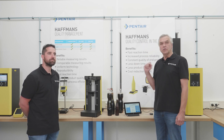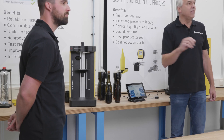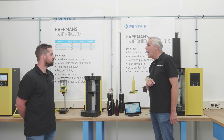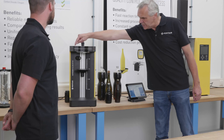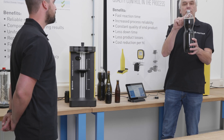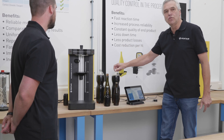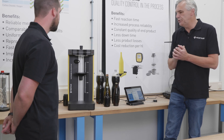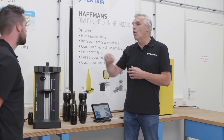The instrument is designed for PET bottles and glass bottles. The principle of the measurement is based on laser technology — non-contact technology. A laser brings the light through the headspace of the bottle. In the headspace there is CO2. The laser is specially chosen for absorption of light by CO2, so the less signal measured from the light, the more CO2.